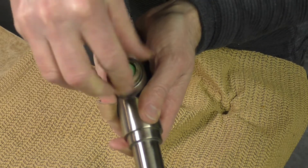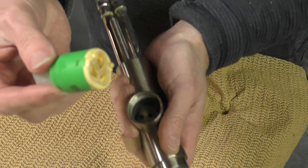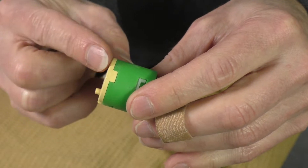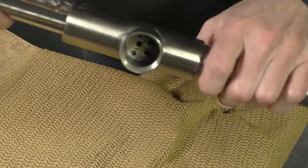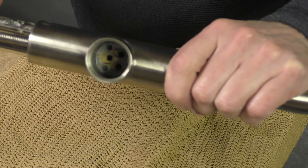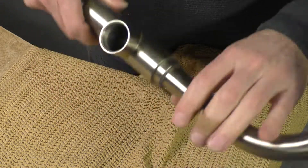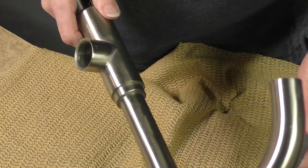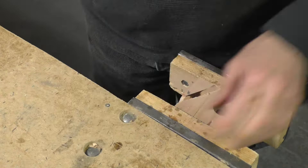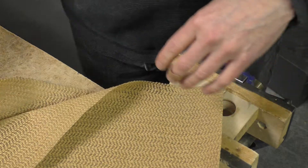Finish taking that off by hand. Once we have that we can take out the cartridge — that's what we need to replace. If you look closely at the cartridge you'll see there are a couple of alignment pins, and inside you can see the holes where those pins go. That's all you need to do to get that annoying bushing off your tap. It's not easily done without a jig — high grip gloves didn't work for me, but a simple hole in a piece of wood with a high friction surface in between gets the job done.